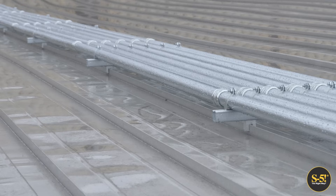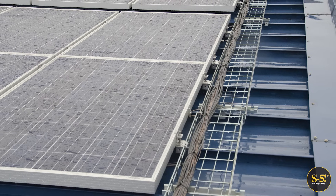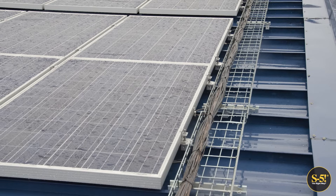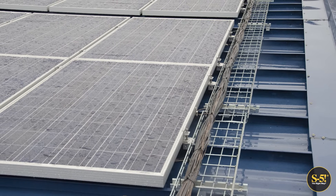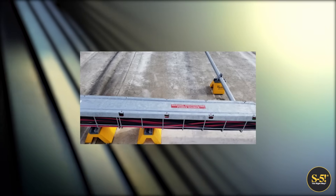Home runs are enclosed or open trays to carry bundles of conductors and ground wires from a PV array to inverters. Trays generally need to be covered if out in the open and exposed to the elements. You can also use combiner boxes to reduce the quantity of wires for certain types of inverters. In addition, we advise you to position the home run on the ridge side of the roof in residential applications. Here is an example of a conduit being used as a home run to route the wires from the solar array to the inverters. This method is used when you want to ensure the wires are sealed in the conduit and protected from weather conditions. This illustrates a wire tray used as a home run. Wire trays are more common because it's easier to put the wires in these instead of pulling them through tens or hundreds of feet of conduit. The cover protects the wires from UV exposure, direct rain, and snow.